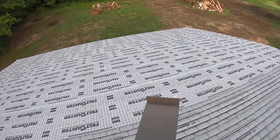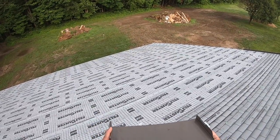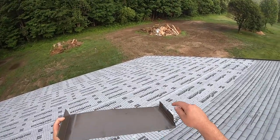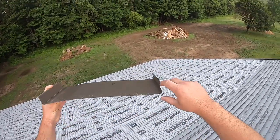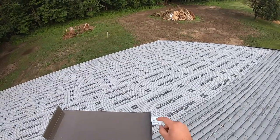Speaking of panels, I thought I'd talk a little bit about the panel profile that I'm using. The panel profile I'm using is an SS450SL. It has a 1.5-inch tall seam and it clicks together. So this seam will click over the top of this seam, and this ridge down there will catch on this little indentation right here and they'll just interlock together. And this side is held down to the roof with a clip.